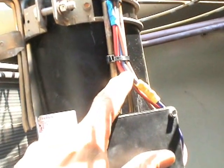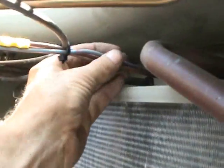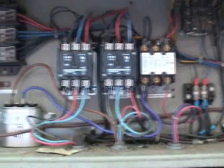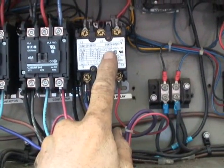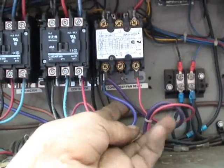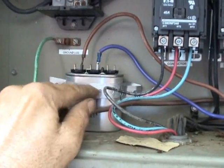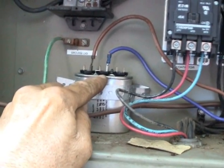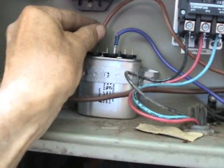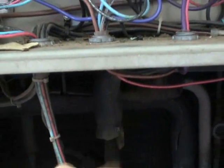I'm going to wrap them all up and put them inside the box connected to the motor. The box is secured and I went ahead and secured the wires with some wire ties, just to keep them away from the fan blade. All the way back to where they go into the control panel — here's the fan motor contactor, here's our line 1 wire, and here's our line 2 wire. It's purple, and it connects to the run capacitor. Here's the common side of the run capacitor, and the 25 microfarad side carries the run capacitor wire back to the motor.